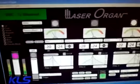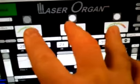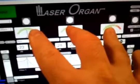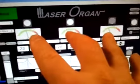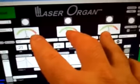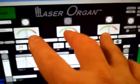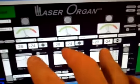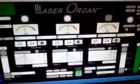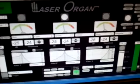that it's not peaking. And for these 3 LEDs up here, if they were constantly on, that would be a bad thing. Or if they were constantly off because the music was soft, that would be a bad thing. You wouldn't have the effect you're probably looking for. And so the compressor does a wonderful thing by riding those levels for you, and it's an extremely handy tool.